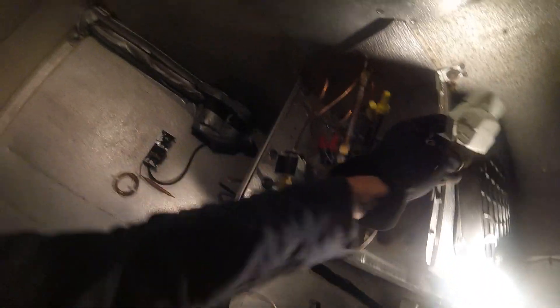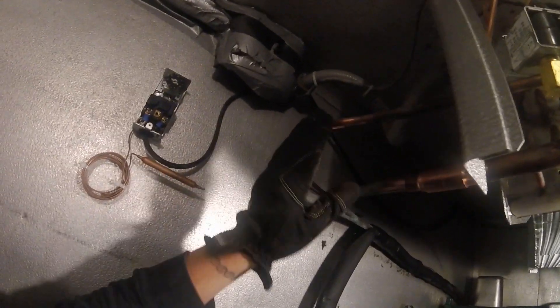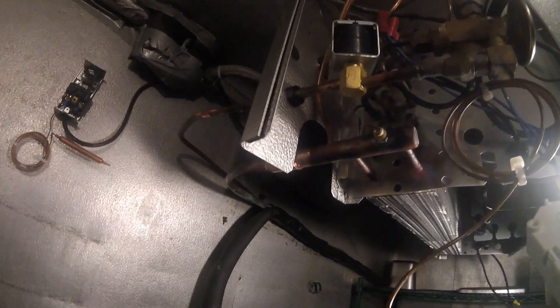We're all mounted. I ran the power into the unit and now I'm going to start the wiring. Wired. I'm just waiting for some nuts and bolts to hang this timer. I got these pipes configured. Before I brazed this, my partner blew out the lines — he swept the lines with nitrogen to get out whatever was in there. And what I'm going to do is pull this pin so we can breathe. At the same time, down at the condensing unit, I had the gauges open just so this thing can vent out.